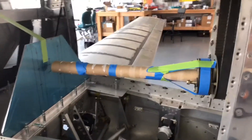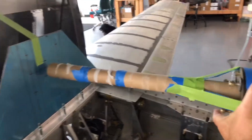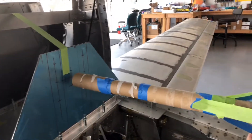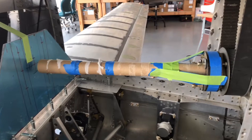BD5 Pilot here at the Hillsboro hangar, and yes, I'm back with some more crazy ideas. Alignment is so critical that I've created this makeshift shaft so I can make sure that the central point for that motor mount is going to be perfectly straight.